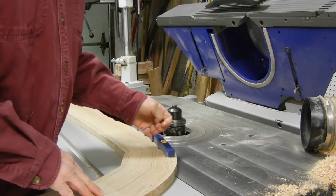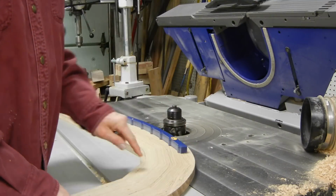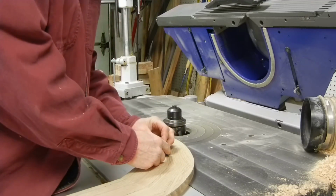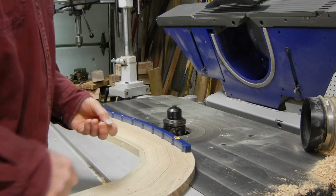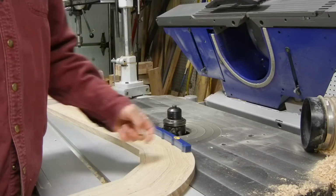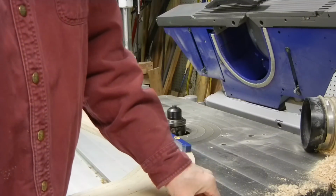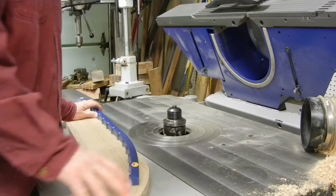So I go in and mark with my line and my French curves how I want the inside-outside radius to be. Then I go by with a small hammer and I'll move the flex curve into that position. Once I get it bent, I'll tap it once, and then I go back in with a 16th of an inch diameter metalworking bit and do a pilot hole. After that, I can put my screws straight in there and they don't walk. If you're going into a softer wood, it still will walk on you if you try to put those screws in there straight away without the pilot hole.